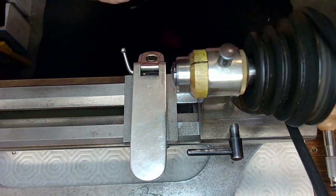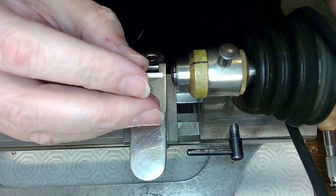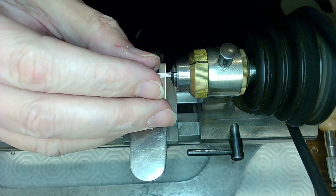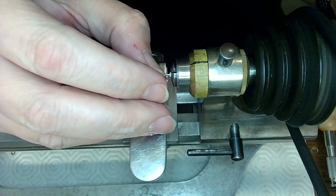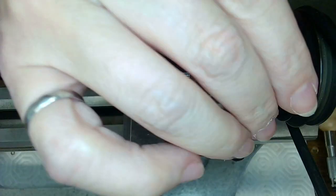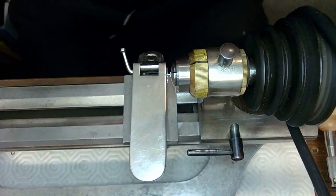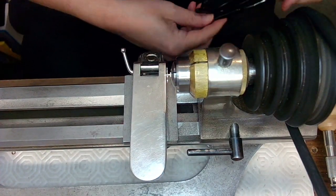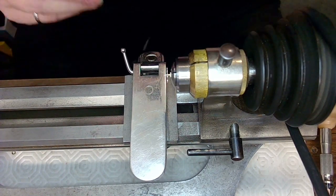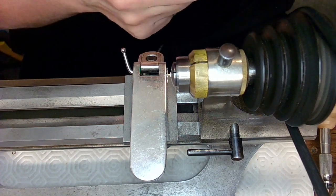And now, I put this thing tapped in pretty deep, which I'm impressed with. I didn't think it was going to go that deep, but it did. So I'm super impressed by that. Now, the trick is to actually get that pivot to the right size, which is going to be really hard. I think I'll use a stone to do that. I don't know if I want to use a graver, because a graver will probably make the results grave.